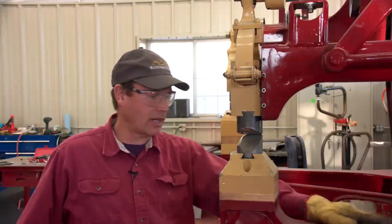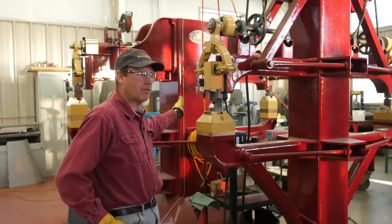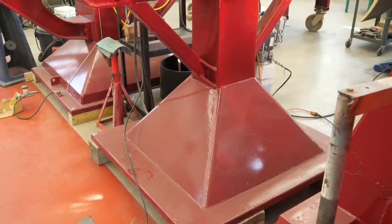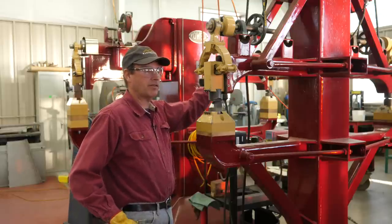Then I took some of the ROPS cabs, or the part that goes up and over the driver, and I cut them up and used these arms here. And I was running it off of a friction fan belt system, and it was kind of a crazy setup and didn't work very well. When I had Steve Powell make this big hammer for me, he offered to fix this hammer the way it really should be. And what he did is he put a new base and gusseted the base. He put gussets on both the bottom here and the top, and he really beefed it up.